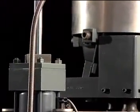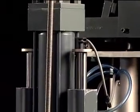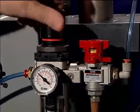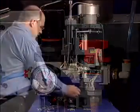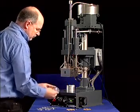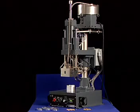Key features of the Model HA include an infinitely adjustable, consistent force provided by the pneumatically driven insertion cylinder. The correct installation pressure is determined based on the plastic material properties and set prior to the production run. This removes the operator-controlled force variable found in competitor's equipment, resulting in high-quality, consistent performance of the insert each and every time.